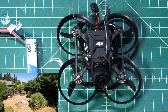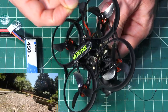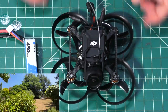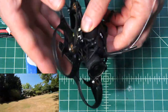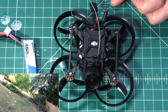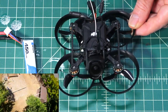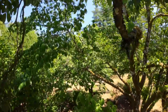This is the hardest to work on as far as putting it together — it took me some time. I really had to slow myself down and be super detailed about my soldering, because I've been doing a lot of soldering on 7-inch, 10-inch, and 5-inch freestyle builds recently and haven't had to put together a tiny whoop in some time. Putting this one together was a pain. But it does have rubber dampening between the O3 unit — it's kind of a two-stage design. It does have 12-amp ESCs, so I'm wondering if I could actually run 3S on here; this thing would be a total beast. As it is, it feels good in the air — you can freestyle this or use it for real estate fly-through videos. It's amazingly fun to fly.